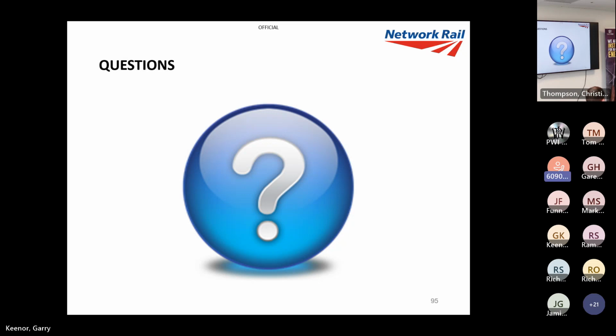It's almost like fixed DTS. We were using it, and then there's been a bit of a void, and it's just coming back in slowly. But we've never had this flexibility before, and it's such a shame because you can see some of the results there. The only thing is, because it really settles the ballast, it absolutely chews up the ballast. So you've got to make sure you use more ballast on a DTS site than you would on conventional tamping, but that's because it's really compacting the ballast. Doing its job. Yeah, exactly.